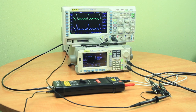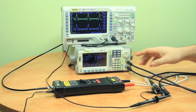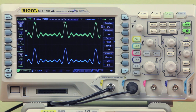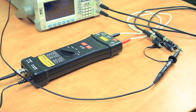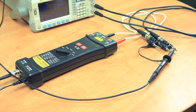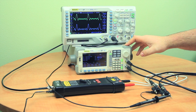To show the difference between a differential probe and a passive probe that comes with one of our oscilloscopes, I've connected channel 1 and channel 2 together from our DG5, where channel 1 is creating the cardiac signal viewed on the scope, and channel 2 is creating a sine wave being pushed into the negative end of channel 1. This will allow us to show some of the differences that the differential probe can have over a passive probe.